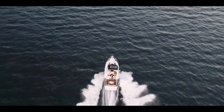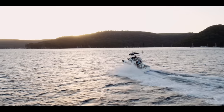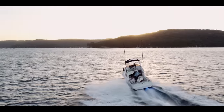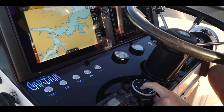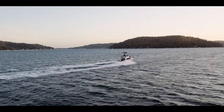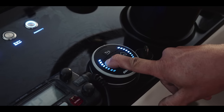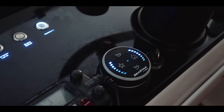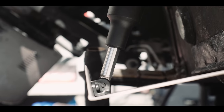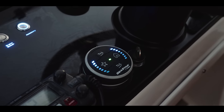There's also a simple favorites button, which is really key. We saw this firsthand today — when adjusting the roll settings, listing the boat to one side or the other, a simple press of the favorites button brings it back to the optimum running angle. To set a new favorite, just press and hold the favorites button for five seconds until you get a blue flashing light, and that position is saved. At any time, pressing the home button retracts the tabs, then pressing favorites automatically returns the tabs to that saved setting.